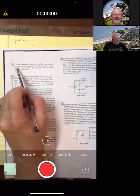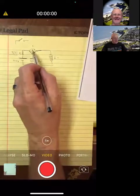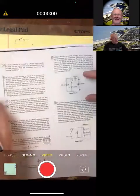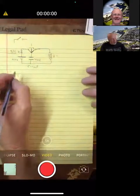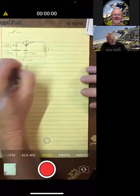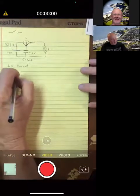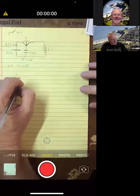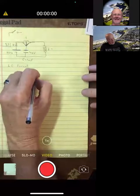So it says here, a fully charged capacitor is then discharged through an inductor. So once we disconnect it, we have it charged, and we're going to let it then flow out or discharge through this inductor. Okay. And that means we have a circuit called an LC circuit. Our LC circuit then oscillates. It starts off with all of its energy on the capacitor. You might say it starts with all of its energy in the form of an electric field.